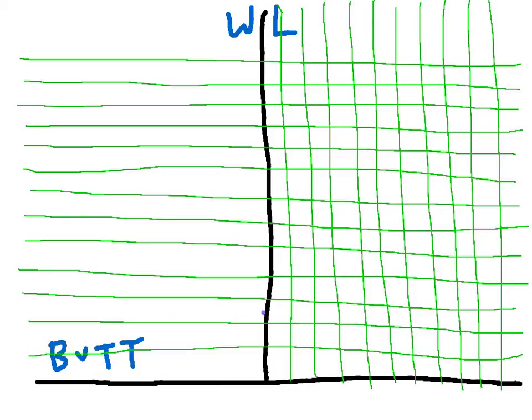The next one down for the two-inch butt line — that's going to be the first line to the right of our origin — I've got one foot, seven inches, so a total of 19 inches. I'm going to come over to that vertical line and go up 19 inches, counting up two, four, six, eight, ten, twelve, fourteen, sixteen, eighteen — and I put a mark right there. So that's our first set of coordinates.